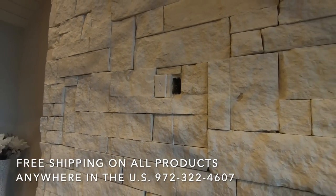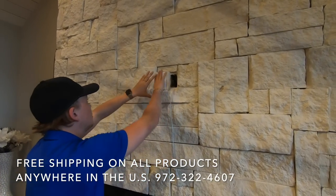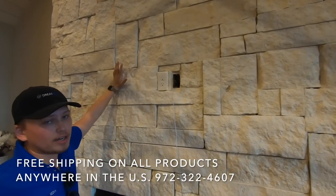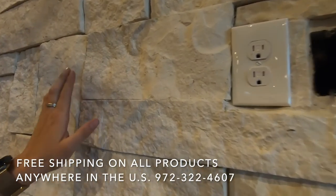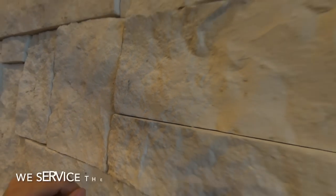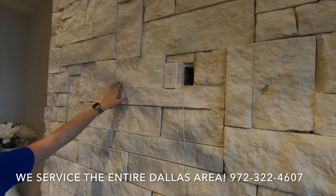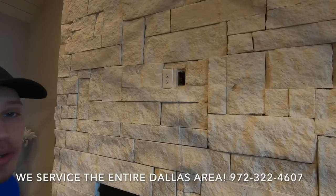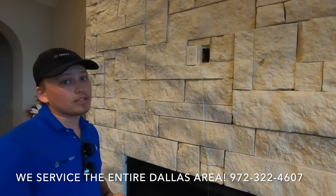So it's gonna sit perfectly over our outlets, and it's gonna hide all of the wires, as well as we're gonna pop this brick out here. And we believe the stud is right here, but we're not totally sure. So we're gonna pop it out and just get a complete verification and make sure we're getting into the wood stud so this sucker doesn't come down.